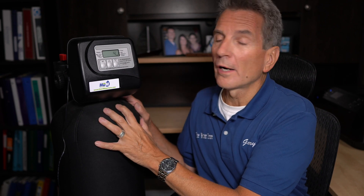If you have more than one piece of water filtration equipment, you don't want them backwashing at the same time. Stagger them — for example, set the water softener at 2 AM and the backwashable carbon filter at 4 AM. Most water softeners with a clock valve take about an hour and a half for a regen cycle, so you need to allow for that. Set the regen time for when there's very low water usage in the home.